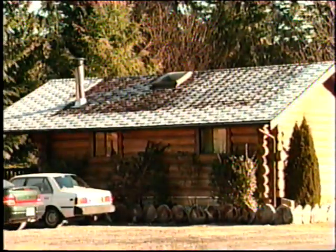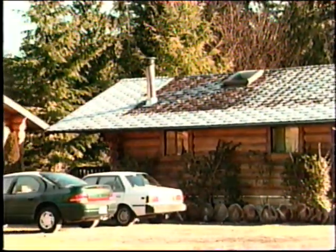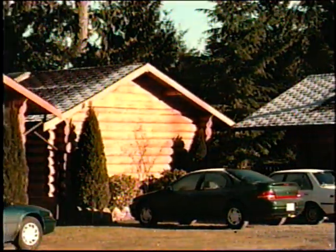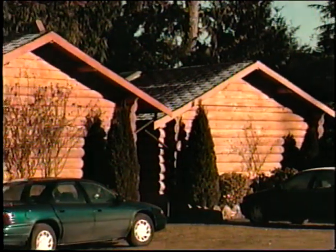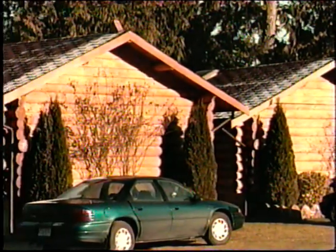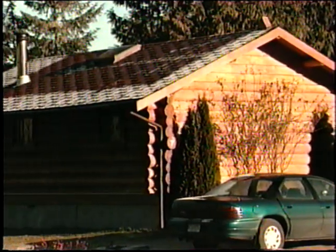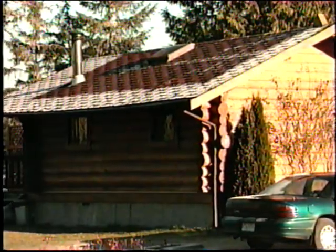A round notch may be a little more difficult to cut out than a saddle notch, and it also requires more experience when it comes to choosing the right log. The reason for using it is that it imparts a more natural appearance to the building.